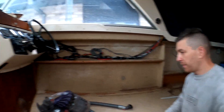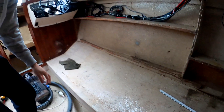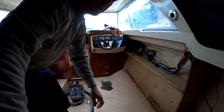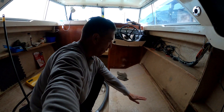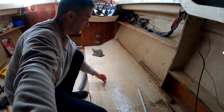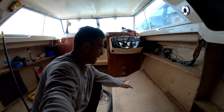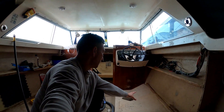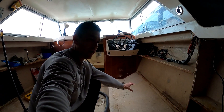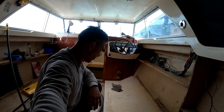We'll have a few design challenges here because the floor does curve up. It's not all perfectly flat like most modern boats are. So what I'm going to have to do is basically build a couple of platforms which come from the side, come out as far as the eskies are going to go, and forward to where I'm going to bolt seat pedestals that are fully adjustable. I want to make this base ridiculously strong and bolt those pedestals in so they are very strong — none of these self-tapping screws or pedestals into the fiberglass floor rubbish. We all know how that ends up.